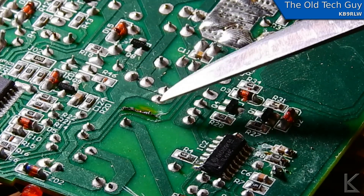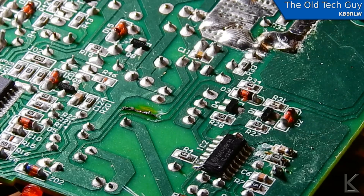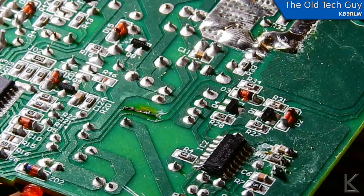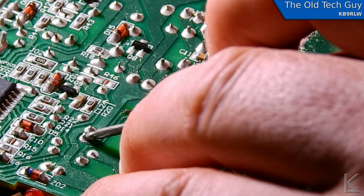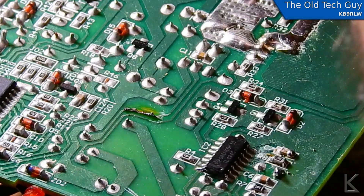It's not quite as neat as I usually do — I don't have a good magnifier, just my thick glasses on. But that looks like we're good. We can probably test that with a meter. Hopefully you could hear that. I'll follow this trace over to this end — it goes to that solder pad. I'll follow it over this way — it goes to this solder pad. And we have a good bridge.